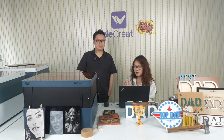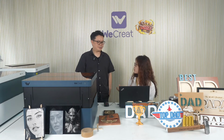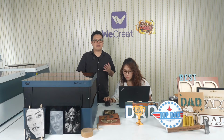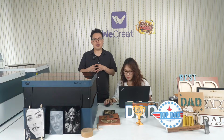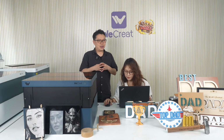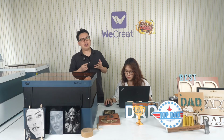But 20 watt is kind of a balance in between, with high cost performance. So the 2 watt is not really meant for cutting. You have to notice, if you want to cut stuff like wood, leather, paper, and all that stuff, then go for the 20 or the 40 watt. And so the 2 watt is really perfect.